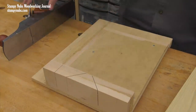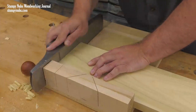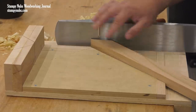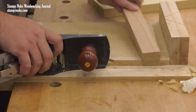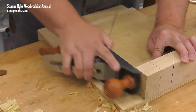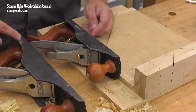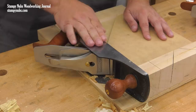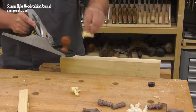The number five and a half is also an excellent shooting board plane. If you're a power tool woodworker who doesn't know what a shooting board can do for you, you owe it to yourself to learn, because a shooting board isn't just a hand tool woodworker's device. They excel at tuning joinery such as trimming miters or correcting small misalignments in angle, or precisely trimming a project part shorter so it fits just right in its place. You can use the number four on a shooting board, but the wider iron of the five and a half can trim thicker stock, and its longer length and higher side also make it more stable and easier to keep square to the workpiece during use. I also think the extra heft of the five and a half adds momentum which makes it easier to push through a cut.